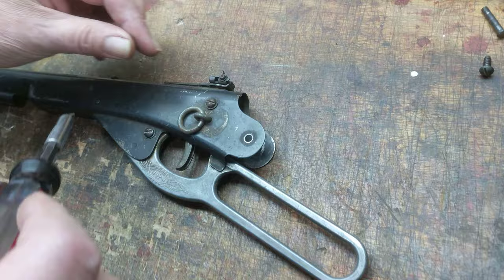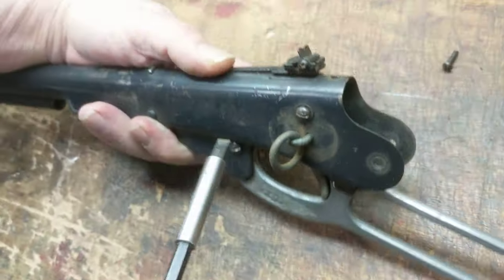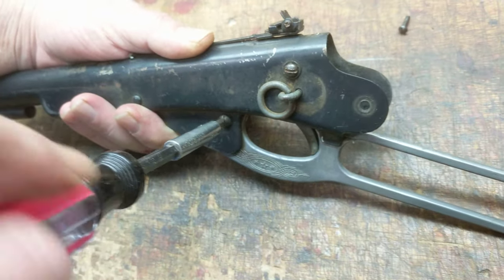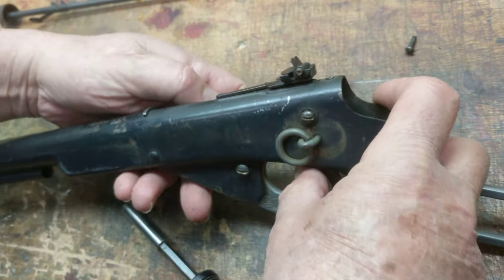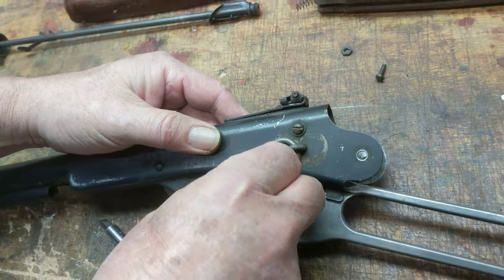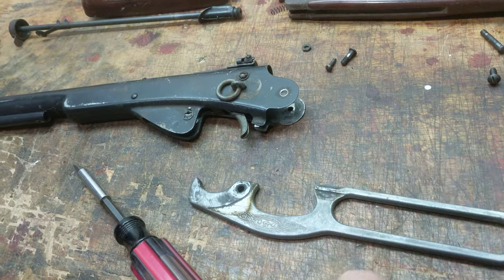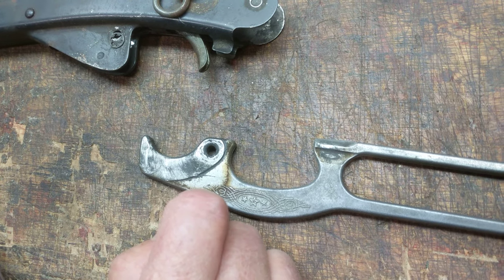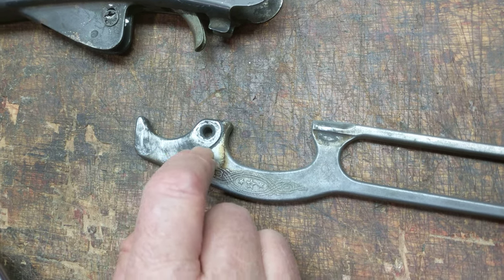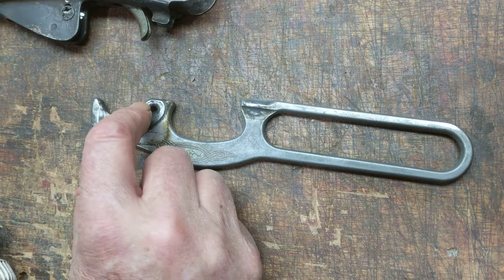Moving along, we're going to remove the lever bolt. This has actually got a nut on it, so I'm going to stabilize that nut with my finger — that's enough to get bite. You just back that rascal out, make sure you don't lose your nut, and then take the bolt out — and the lever should pop free. Most Daisy levers on high pivot guns have a rather high frill on them; this one doesn't. I've seen another one just like it. I haven't done research on whether this was a transitional model lever, but it's kind of interesting — we'll look into that more later.